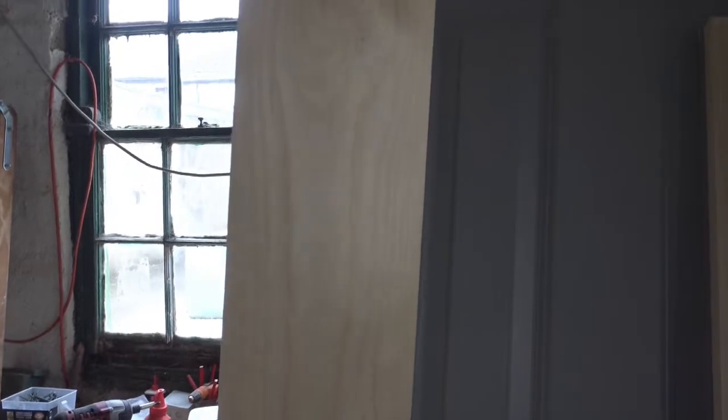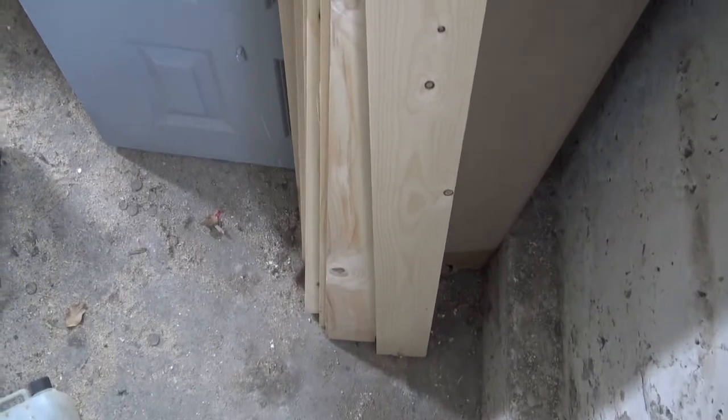When you're buying planed timber — I'll show you the difference — the slats of the bed I bought already planed because I didn't want to sand all of these. You can see it's even shiny from how much it's been sanded and the edges are so good. You can make furniture from this stuff because it's so square and sharp. I've sanded the ends from where I cut them so there are no splinters, but clearly this planed wood is ready to be used — all edges are square, all pieces flat and straight.